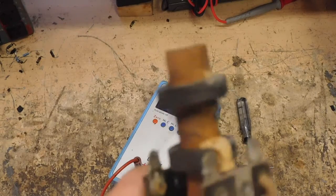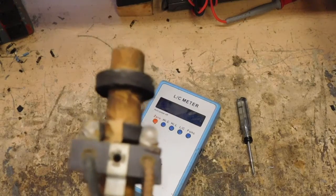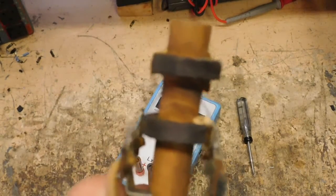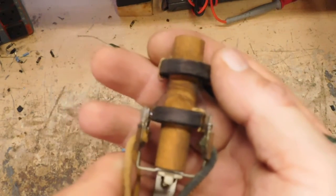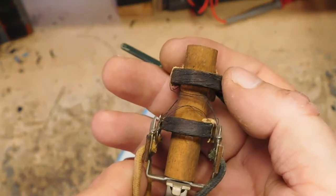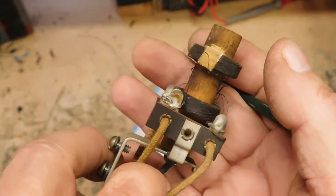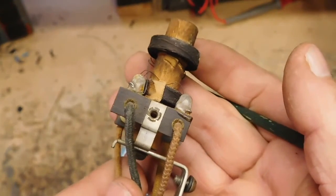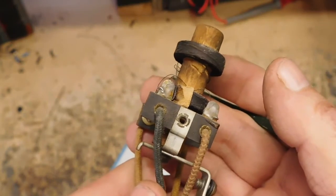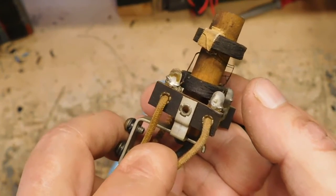Well, that's going to be nerve-wracking. So these are factory set. They probably will never change. As long as the insulation on the wire stays good, in other words, it doesn't burn out, because if that insulation goes bad, it's going to short the coil out anyway. So as long as that insulation stays good, that capacitance is not going to change. And of course, the coil is not going to change as long as the insulation stays good. So these will stay tuned where the factory set them.